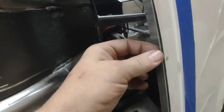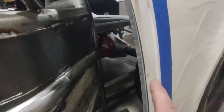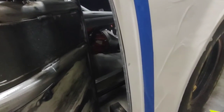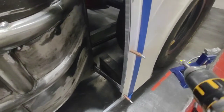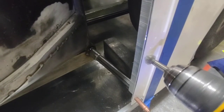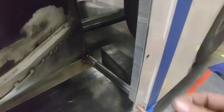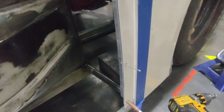I can put the door over top of this and rivet it down — it should clear the back of my panel because it's only a half inch thick and I do have it a little bit exposed over the edge. I've calculated it so when I drill this I can go right in behind it and I'm only attaching my door to the quarter panel, not necessarily through that extra piece. These hidden rivets will keep the door from being humped up. I'm only using five of them. You've got to make sure you get a countersunk drill bit — this is fiberglass, so it does not take a lot. Just bump it a tiny bit, put your countersunk rivet in, verify it's completely below the surface, then pull that rivet.